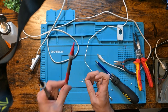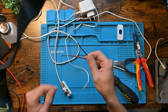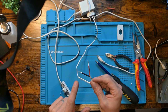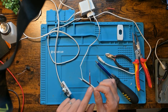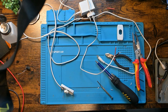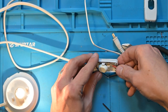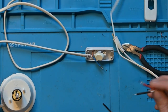If you have a positive value when you have the red prong, that's positive. So I just grabbed some shrink tubing — one red, one black — so I know which one's positive and which one's negative. This helps me identify polarity, but it also helps because after I make my connections, I can just pull this over, heat it up a little bit, and it's sealed and isolated. So I'm going to add a little bit of solder to the ends here. Quick test — if I make the connections like this, does it work? Very clearly it does. If I hold the leads together, I can turn it on and off. This is going to work.